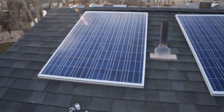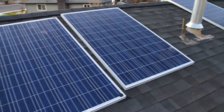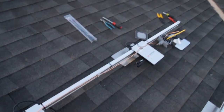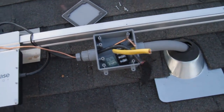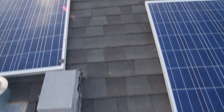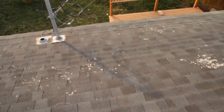These are our panels — 245 watt Canadian Solar panels. I've got six of them in series and we're doing an Enphase system using Enphase inverters on the roof. Here's my junction box; went right through the roof, right through the attic, and ran the wires using Romex 12-3 in through the attic.